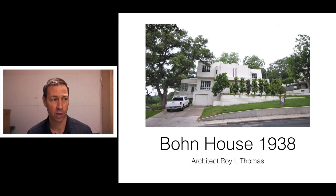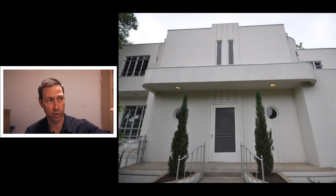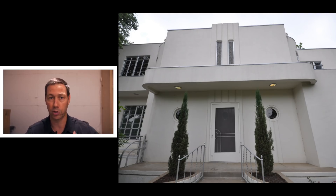First, let's look at this house right here. This is a pretty famous house here in Austin, Texas, just had its 80th birthday or so. Pretty modern construction even though it's 80 years old — no overhangs, some really interesting architecture, kind of an art deco house. Interestingly enough, it doesn't look all that different from some real modern brand new construction houses. This is traditional three-quarter inch stucco, no overhangs really to speak of. You can see that wall goes all the way up and then transitions to a flat roof.